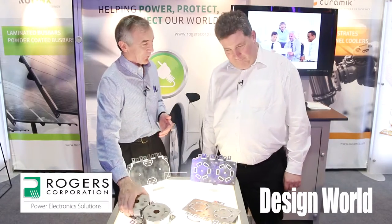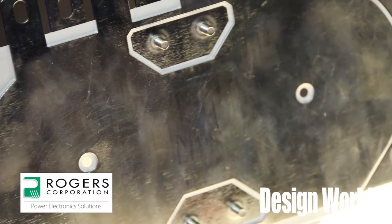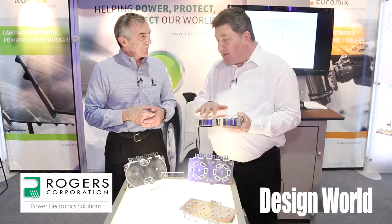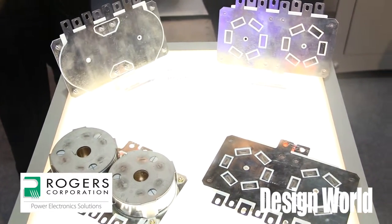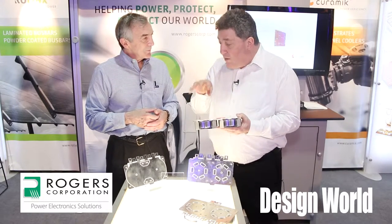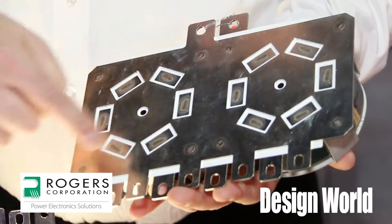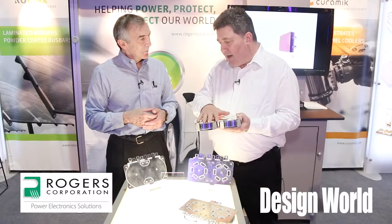Tell us exactly how these are connected here. Well, the usual way of connecting a capacitor to a bus bar would be nuts and bolts or maybe soldering them to a bus bar. But if you want to get to the best low-inductive solution at the taps of the IGBT, you need to really integrate them together. So we partnered with SBE, who's making these unique capacitor rings, to connect them together. This is a welding technology that goes directly to the capacitor winding, taking out all of the inductance, only leaving the inductance towards the taps of the IGBT.